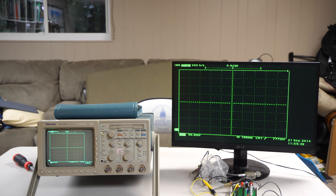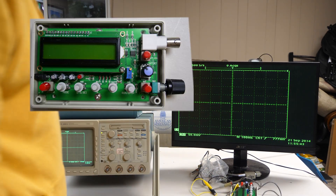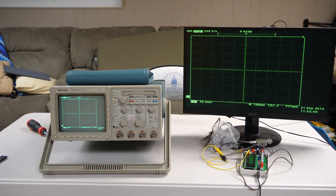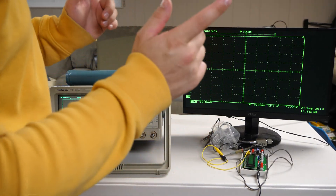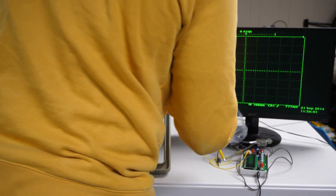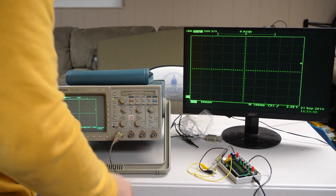But, if we were to go and use a signal generator — which we have right here — or function generator, we can take the signal and actually capture it on something like this. Using a VGA to HDMI capture card, we should be able to capture it. Right now, what we're going to do is hook up one of our signal probes and see what this looks like on the actual dot matrix screen.